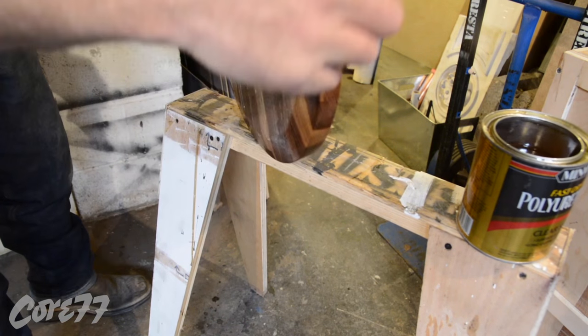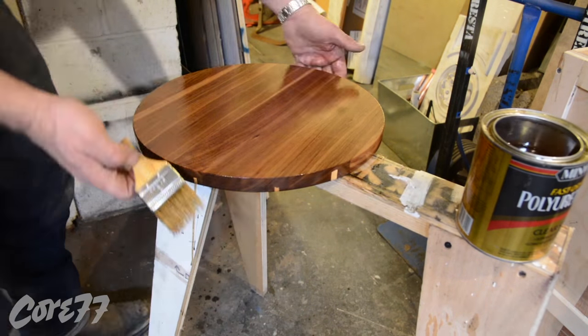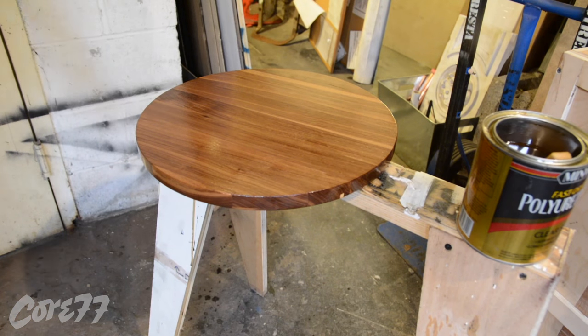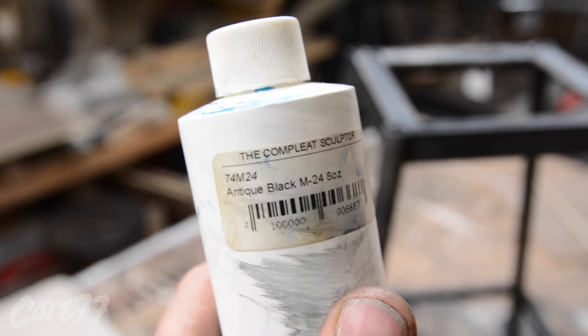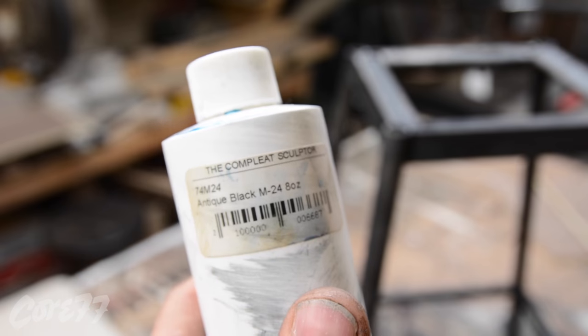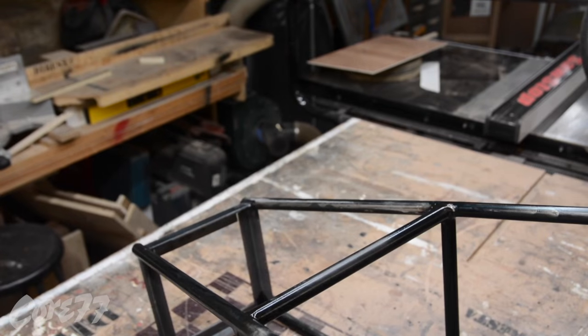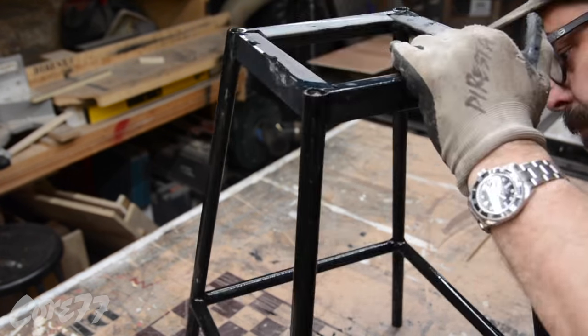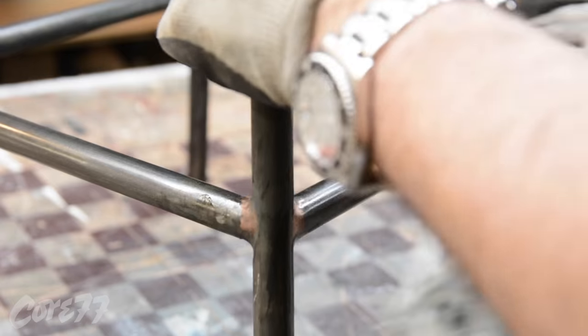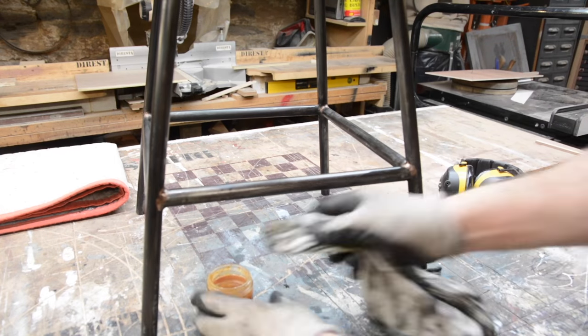Just polyurethane — for this video I only gave it one coat, but ultimately I would give it three or four more coats. This is from the Complete Sculptor — it's called Presto Metal Blackener. I'm showing that for a long time because everybody asks me what this is. Watch how quick it works on bare steel — it turns it black almost immediately. The interesting thing is that it does not work as well on the bronze, so the joints all show a little gold, which I like. This is oil — it goes over the blackener and gives it a little protection from rust and makes it a little glossy, so it looks like aged blackened metal, which is something I personally like.